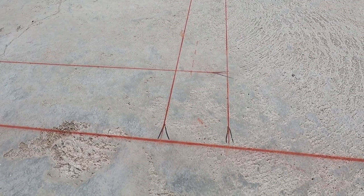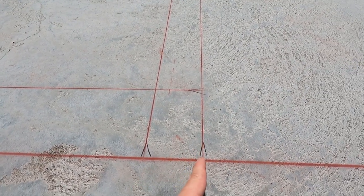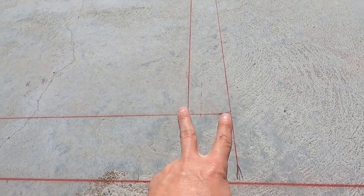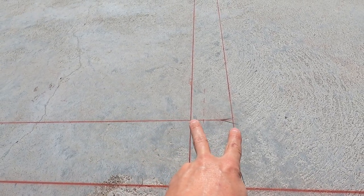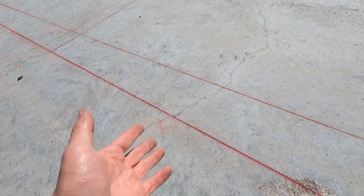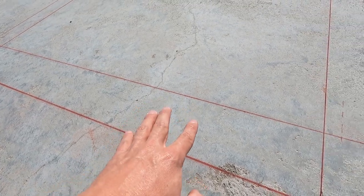What I really like is that everything is chalked out not just with a line saying outside or inside — it's the actual dimensions of the wall. So they know this is a 2x4 wall, this is a 2x6 wall. There are changes throughout, but dimensionally it's all chalked out. They do all the questioning right now, get it laid out and mapped out, and then it's just go time.